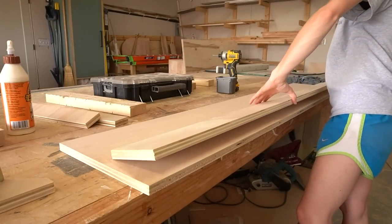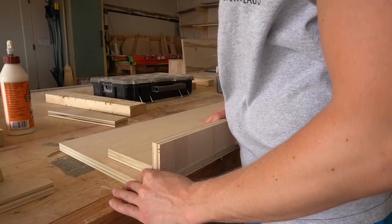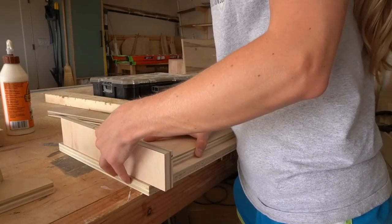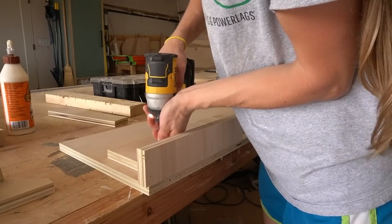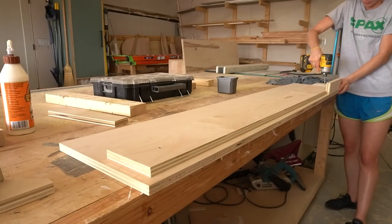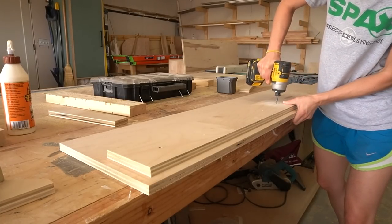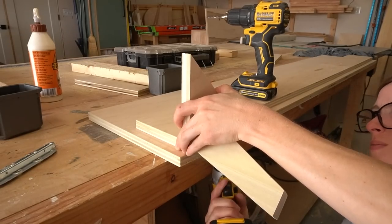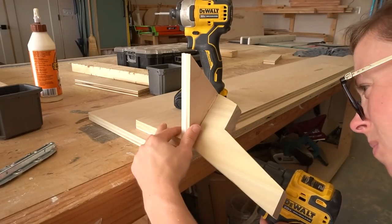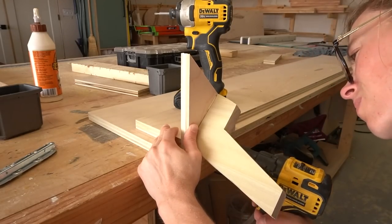The footboard was just a solid panel like the headboard, but without the frame. I cut down a piece of plywood for the footboard, then cut a piece of 5 inch wide plywood to run across the backside to keep it rigid and allow longer screws for the brackets. I cut this back piece about an inch and a half narrower than the footboard panel to leave an extra ¾ inch base on each side, and glued and screwed it in place ¾ inch up from the bottom edge and ¾ inch in from each side.